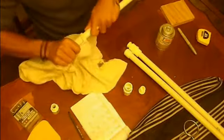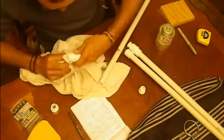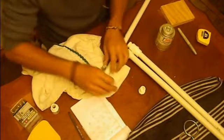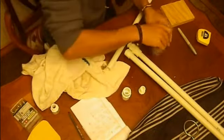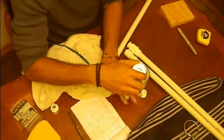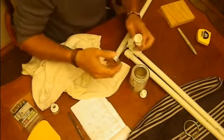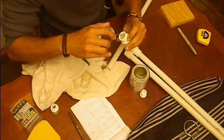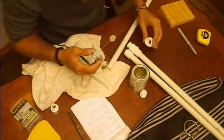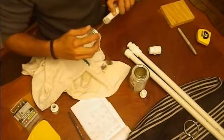After measuring and cutting your PVC, we're going to clean up the ends of the PVC a little bit, clean out the wells of the PVC adapters, and attach them with a little bit of rubber cement. Not rubber cement, rather PVC cement. I want to cover the pieces pretty well, get them in there a nice amount, but not enough that it's pooling, and you definitely don't want to get any on the threads. Stuff pretty much melts the PVC.